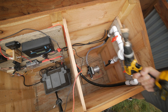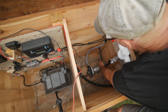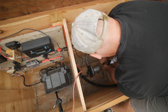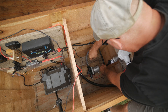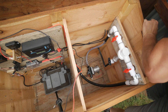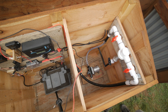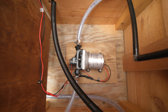The spin-down sediment filter has a valve at the bottom so you can quickly remove some of the debris that builds up. For this sediment to drain, I'll drill a hole through the box and connect a half-inch hose. A black three-quarter inch water line runs into the box from the bulkhead float fitting on the tank and is connected to the barbed fitting on the filter assembly, and the outlet of the filter to the inlet of the pump with a clear braided hose.